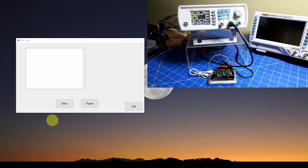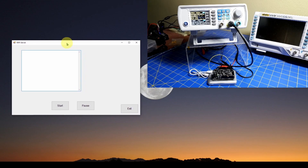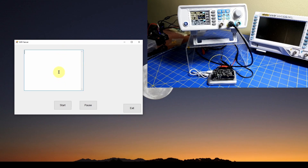There are only two wires coming out of the signal generator feeding into the digital input on the Arduino — totally disconnected from the computer with no USB connection except to the battery powering it. It is taking that 60 Hz square wave, converting it into a value of 60.00 Hz, and sending that string over WiFi to our computer. Here I've got the application we built before, tweaked for this series, grabbing that value over WiFi and displaying it. I'm going to start it up and you can see it immediately printing out values received in real time from the signal generator.